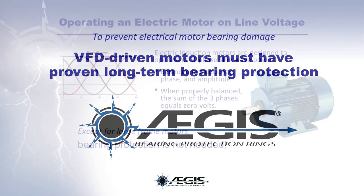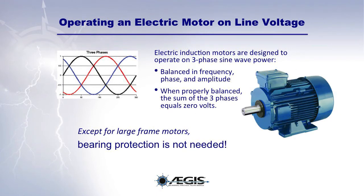ring. So let's look at the difference between when electric motors are operated by line voltage and when they're operated by a VFD. When electric motors are operated on line voltage, the input power is balanced in frequency, phase, and in amplitude. The sum of the three phases always equals 0 volts when properly balanced. Note that bearing protection generally is not needed except for large frame motors in this situation.